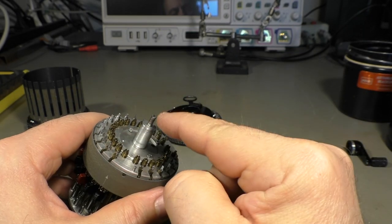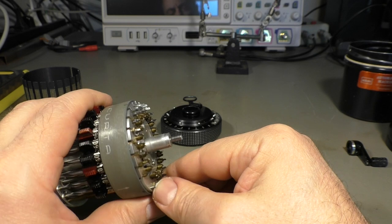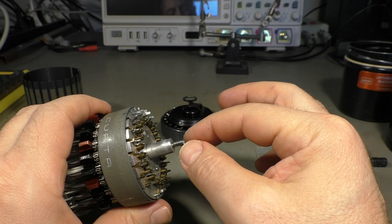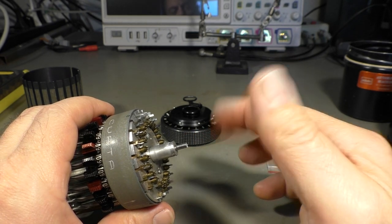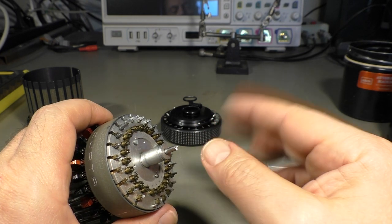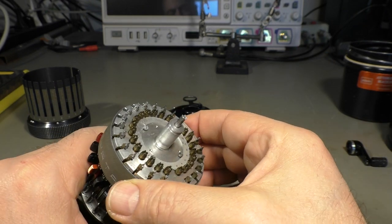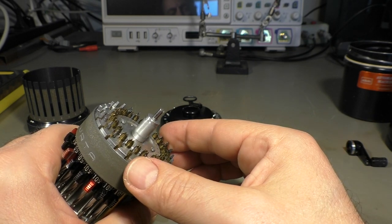Okay, and my idea is to braze it to the part here, so braze the two parts together. For those who are unfamiliar, brazing is like soldering, but with a solder that has a much higher melting temperature. It's also called hot soldering. You use silver solder or maybe brass or something with a melting temperature between 600 and up to 900 degrees. Depends on the material you choose. So I've chosen one that should melt at 670 degrees.